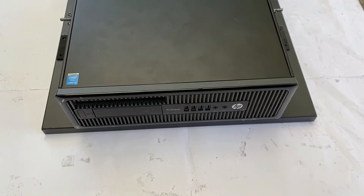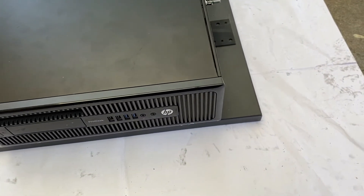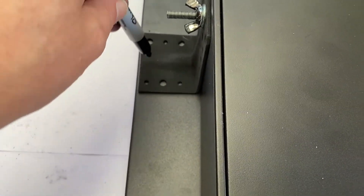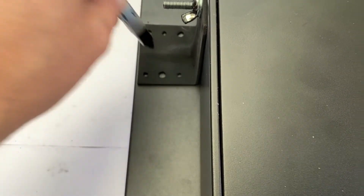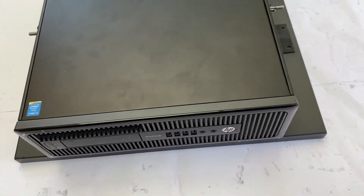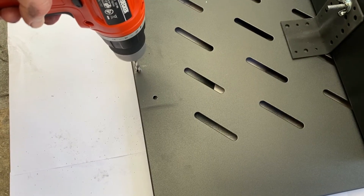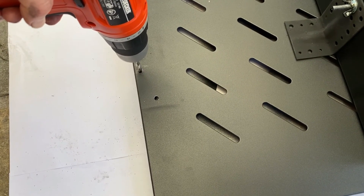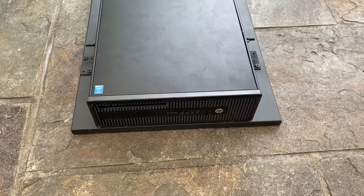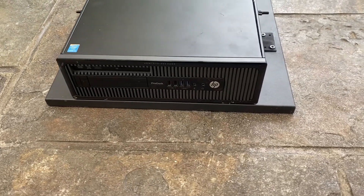Here is my 19 inch tray and I've put my PC with the brackets on top of it, flush to the front — that's the position I want. I'm going to mark the position where I want the bolts to go through to hold it in that position, then drill it — again with a 6mm drill bit for my M6 bolts. We've put in a couple of bolts and fixed it to the tray.